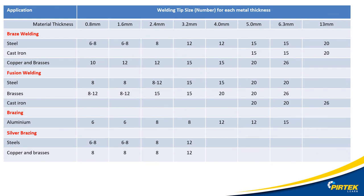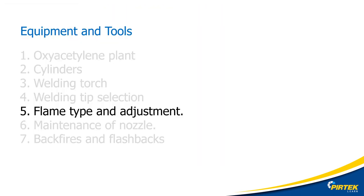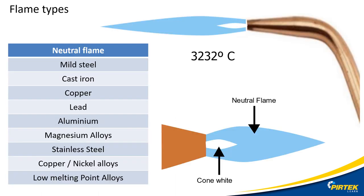This chart describes the different tip sizes required for different materials and sizes. There are three main flame types: neutral, which is balanced; excess acetylene, which is carburizing; and excess oxygen, which is oxidizing. The neutral flame is the first and most commonly used, as it does not change the mechanical properties of the material being brazed. A neutral flame has a balanced ratio of acetylene and oxygen. In today's example we will be silver soldering mild steel to copper, utilizing the neutral flame.